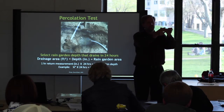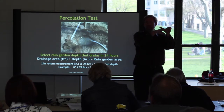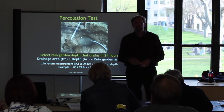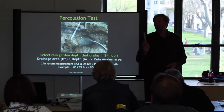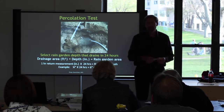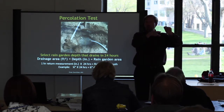So you got your hole, you filled it up with water, you put the tongue depressor in, and then you let the water soak into the ground. And you actually walk away for a very specific amount of time. The specificity on your time is up to you. I tend to go an hour. Okay? And then after an hour, you go back out and you measure how much water has gone down.